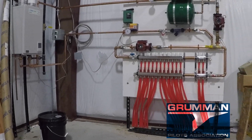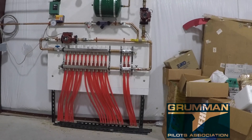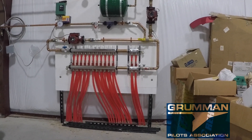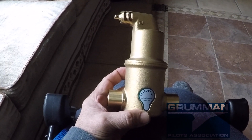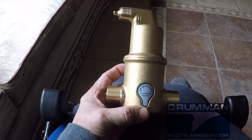It was during the pressure test that we found out we had a little bit of a problem — we had four leaks. That was because the one-inch pipe was BSP on one end and NPT on the other. This is the air eliminator; this one has sweat fittings on it. It weighs about three pounds and is made of cast brass.